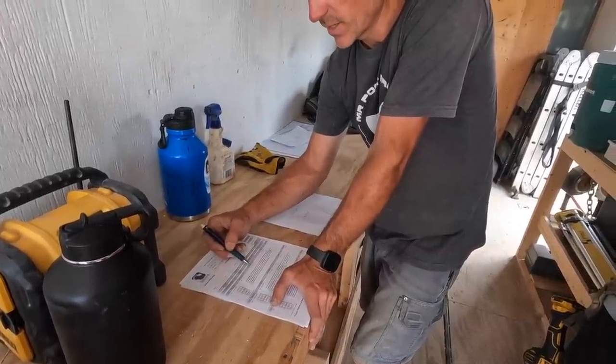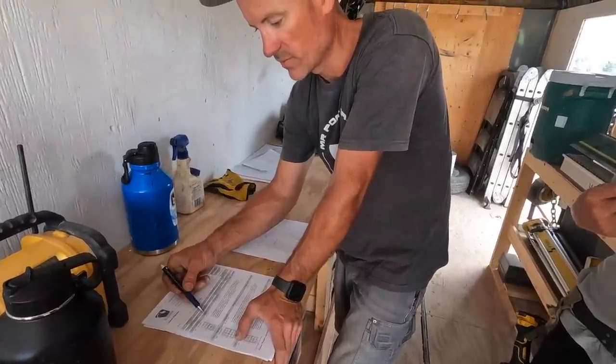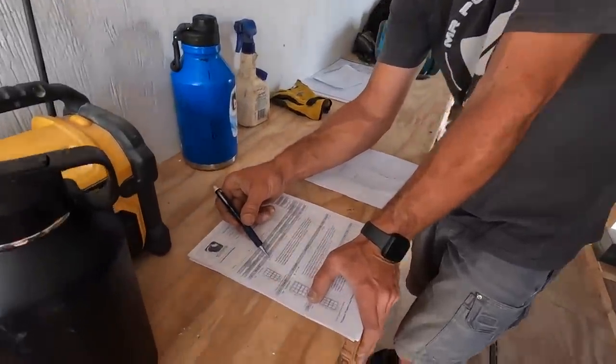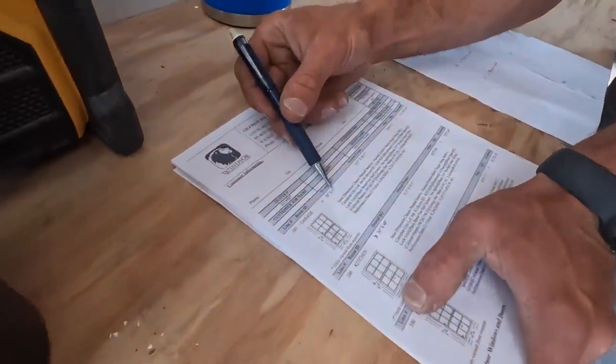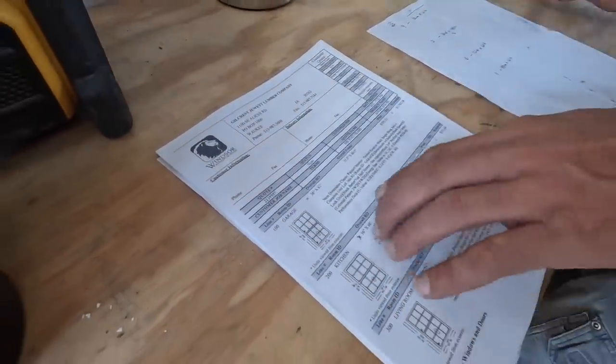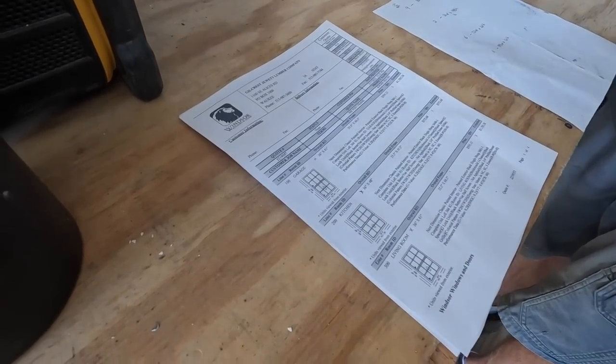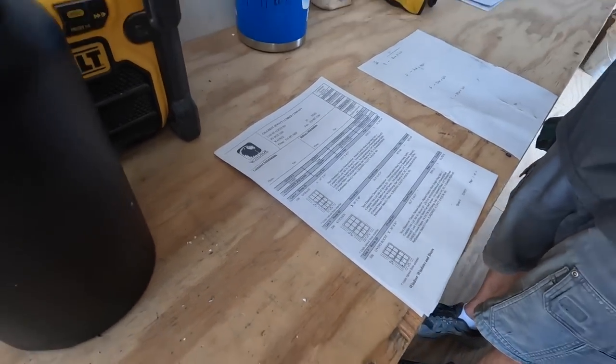So they basically give you a half inch because here's the actual dimension of the window. It's very important that we make it that because that'll give us a quarter inch on each side. So that's how you would read this. Wherever it says RO, that's the box you're making. That's what the inside dimension of that has to be.